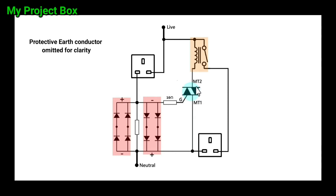This volt drop is fed through a 10 ohm resistor to the gate of a triac — any sensitive gate triac would do here. I used what I had at hand, a 4 amp triac, but you can use one of those small half-amp triacs. This then drives the coil of a 230 volt relay. You might think, why do I need the relay? I could just use a 10 amp triac and drive the load directly from the triac. Well you could, but you need a snubber network as well, which adds complexity. Also, a relay is just a pair of switch contacts which gives you a nice clean output, so you can switch any sort of load — whereas triacs are quite fiddly with their loads.